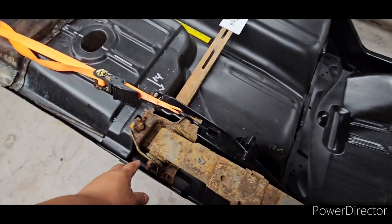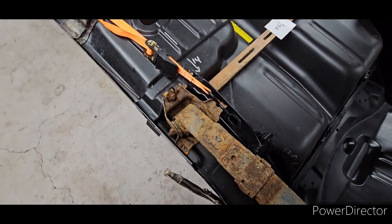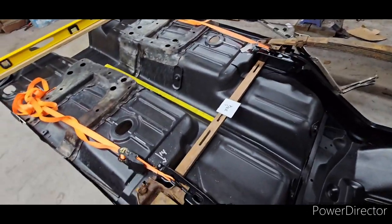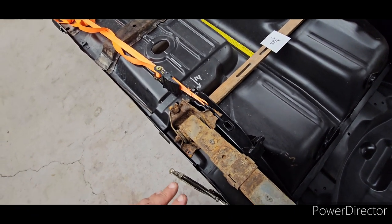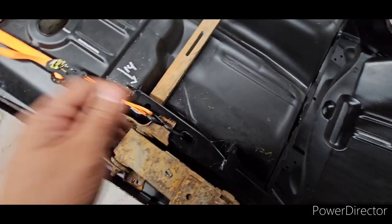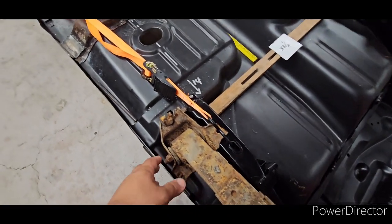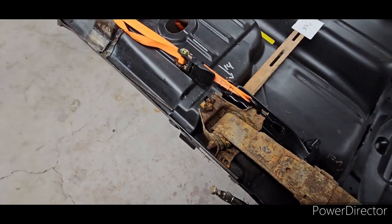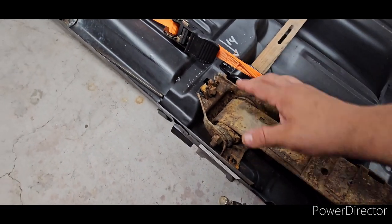With the shackles and the perch pocket here — the leaf spring eye. This is why I've been so successful in building these cars, whether using a jig or a rear frame jig. You need to make sure you have space here and the right measurements for the holes to match up. If you don't give the proper spacing for these brackets, you're not going to be able to mount it. So you've got to give yourself the right spacing — watch the mounting holes. All the mounting holes on this one go right in; it's not going to fight me.